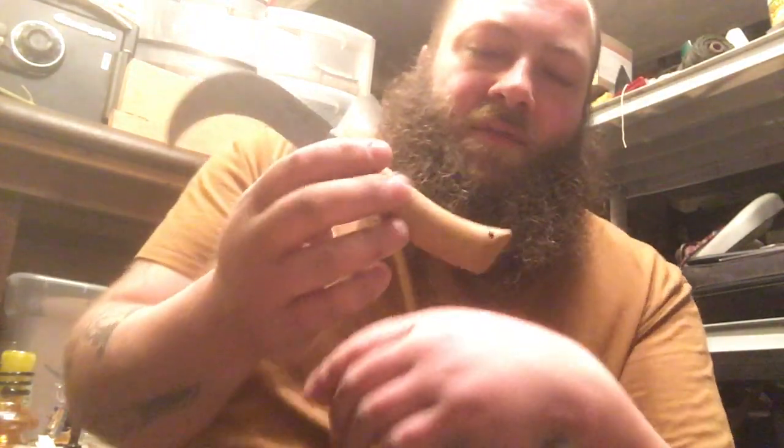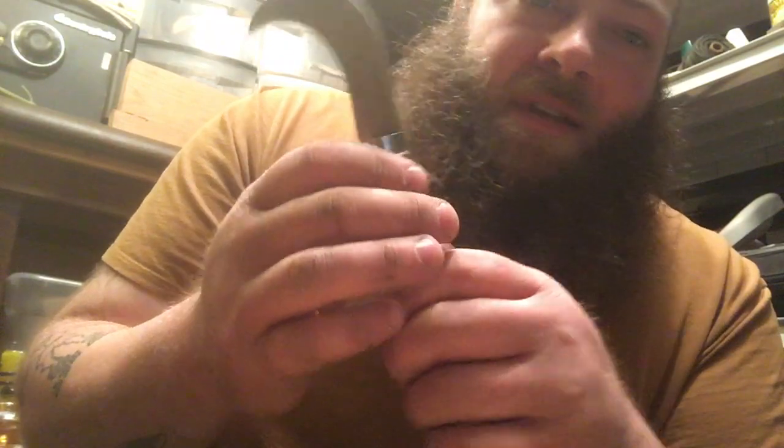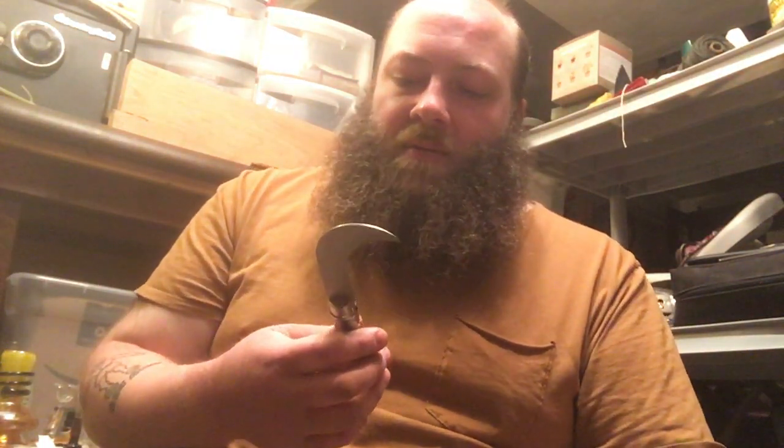And this isn't the original finish. I sanded it down, made it a little smoother, and then I treated it with some boiled linseed oil and Danish oil. Just kind of mixed, or I did a layer of one, a layer of another. Just kind of messing around. I'm happy how it came out. But this is very good as well.